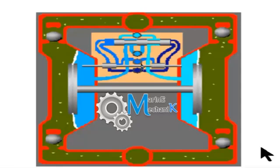Now let's go to the pilot side. This is the pilot inlet and the pilot drain. The pilot valve is at a central position over here now. So the air goes here and then it's getting blocked. It cannot go behind this main valve and operate. But on the other side, you can see the pilot air can go through this, and it has pushed the main valve. It also gets filled up in the drain chamber, but it cannot drain because the drain is being blocked.